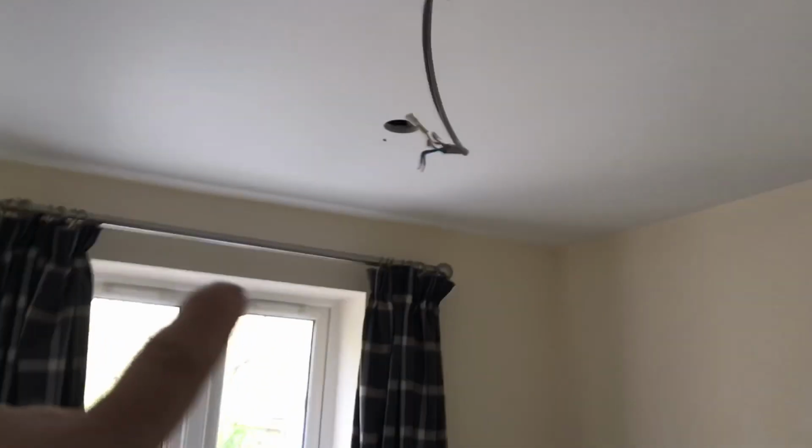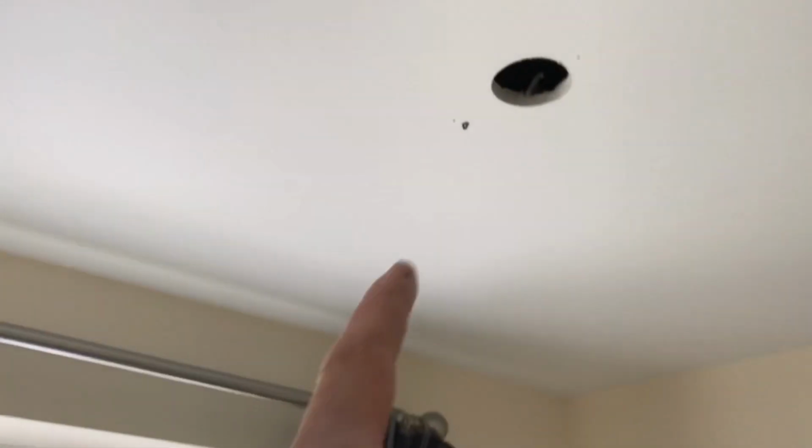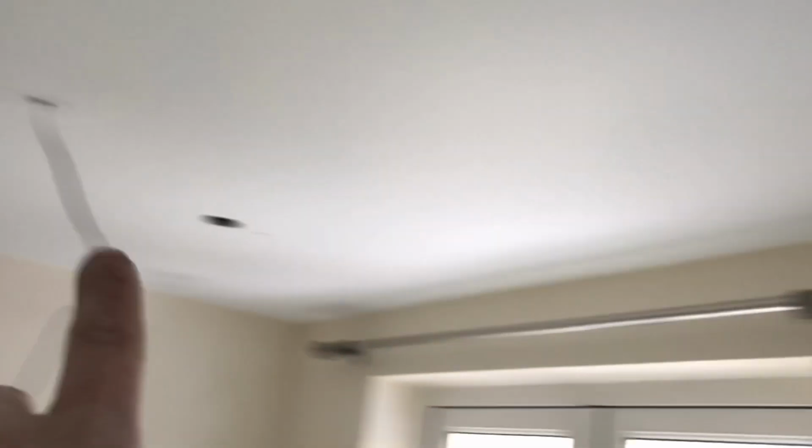Yeah, so there we go. That's the 4 holes drilled. The new downlights. So I've come in a metre, and then that one was 700 from this wall. But when I braddled it, there's actually a joist, so I've come in another 10 centimetres. So that's at 800. That's at 800, but it looks square with the room.